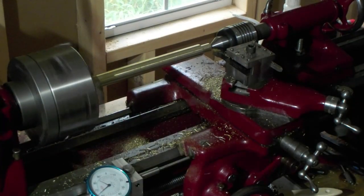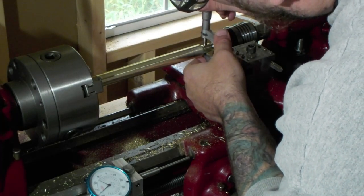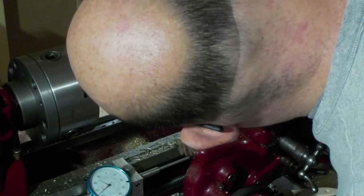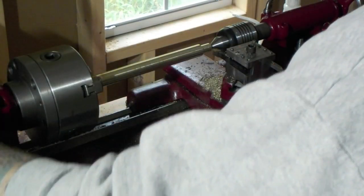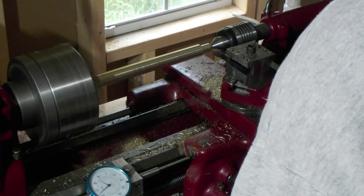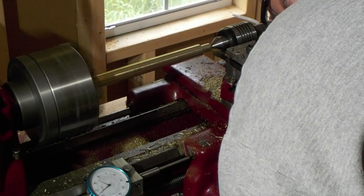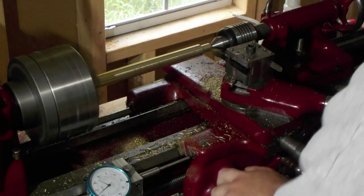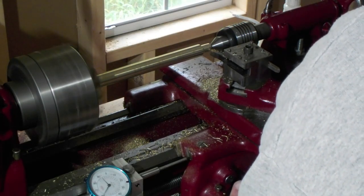I'm going to measure again because this needs to fit inside of a 500 thou milled countersink. So you actually want like 499. So we're at 516. I'm going to take 17 off. That way it fits in there much easier. 17. 10. 12. 14. Get a little extra, 18 off. I'll show you why we do that, a little undersized.